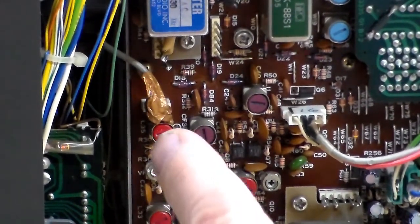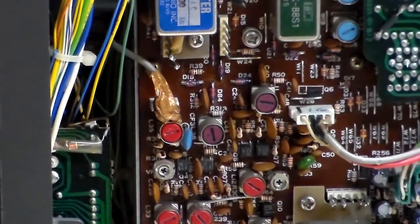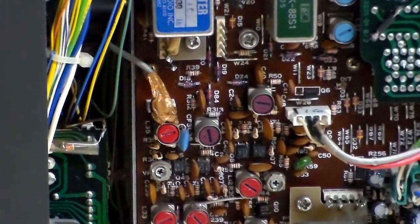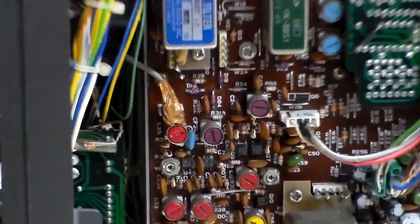So I wanted to try and manipulate that connector a little bit and see if I could simulate the problem. The main thing I was getting was receive dropping off a little bit, and my AM carrier went from 25 to 0. I'm going to try that right now and just see what happens.